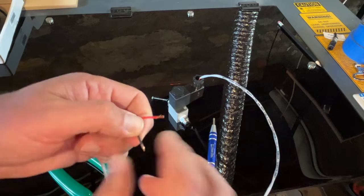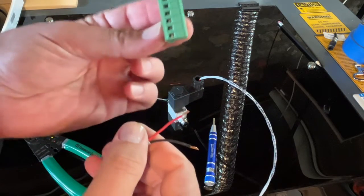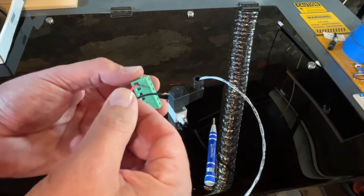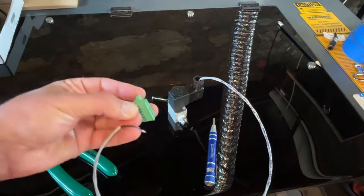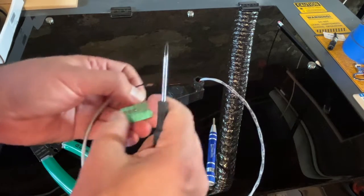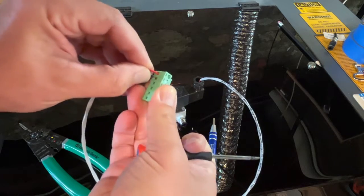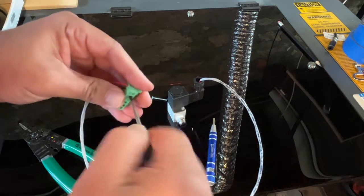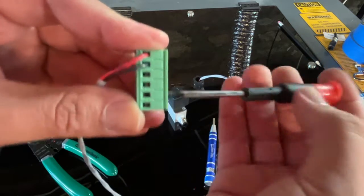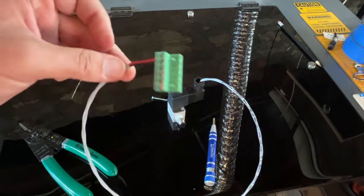For the controller side, we have our positive and negative wires. As I showed at the beginning of the video, on that controller there's a pin for 24-volt positive and a pin for wind. This plug will be going into the RUIDA controller — the first top pin is your 24-volt positive. Insert that wire and tighten it up. Same thing on the negative. With these little plugs, as you unscrew them it opens up the slot, and as you close it, it cinches down on the wire — make sure it's opened all the way before you put your wire in. Our connections are made.